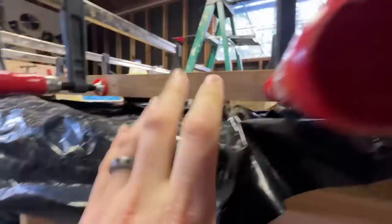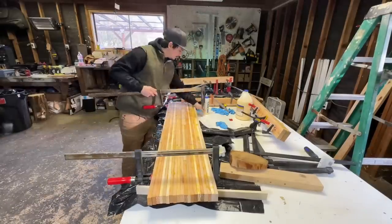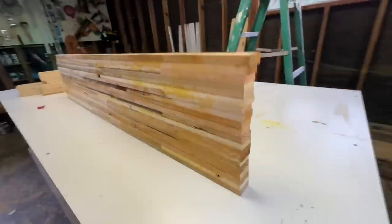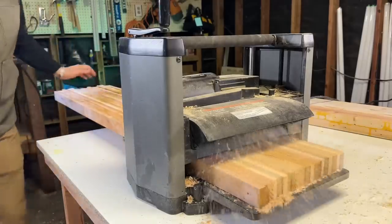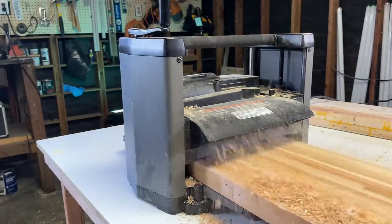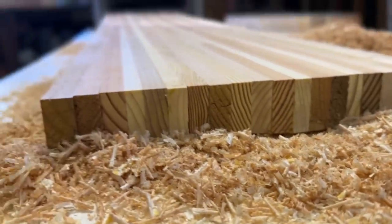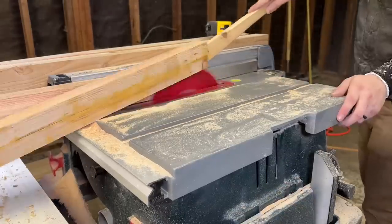After the first night I actually removed the vertical clamps and shimmed this up to allow airflow underneath it. Because temperatures are pretty cold, I had a feeling the glue wasn't dry on the bottom — and it wasn't, so I'm glad I did this. Now I put the slab through my planer to flatten it out. I designed it so it would fit in my planer. If you don't have a planer, there are other ways like a router sled — I actually have another video on that which I'll link at the end. For the legs, I only planed one face — I didn't want to lose a lot of material, so I just took off one face to flatten it.